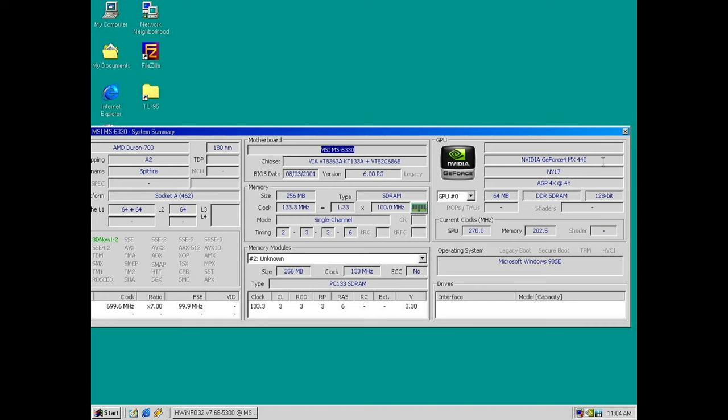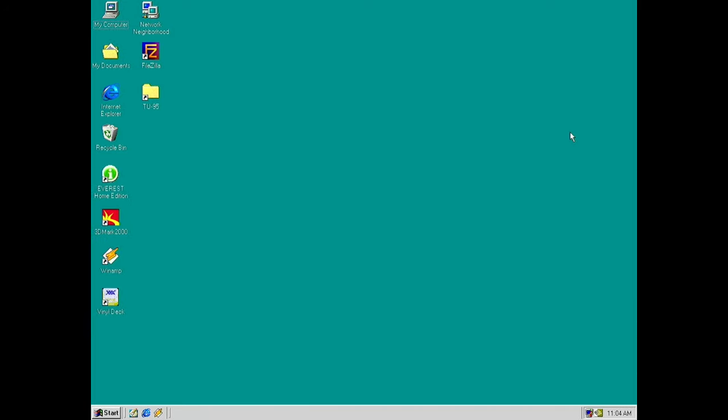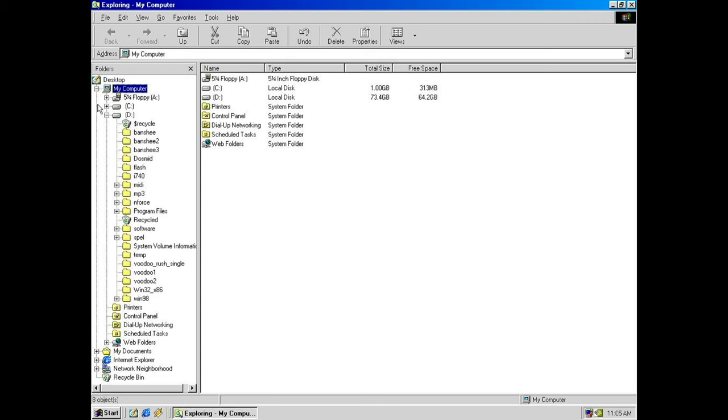And we got the GeForce 4 MX440 here. I don't know if I can see the BIOS revision here. Yeah, you can see, not the model, the BIOS date here. But I know it's 2.9 because that's what it shows at POST, and it seems like we need 3.0 at least for supporting Athlon XP. That's the first mention of Athlon XP I can see.